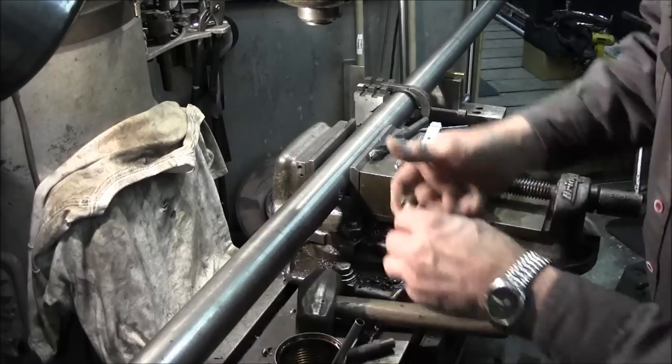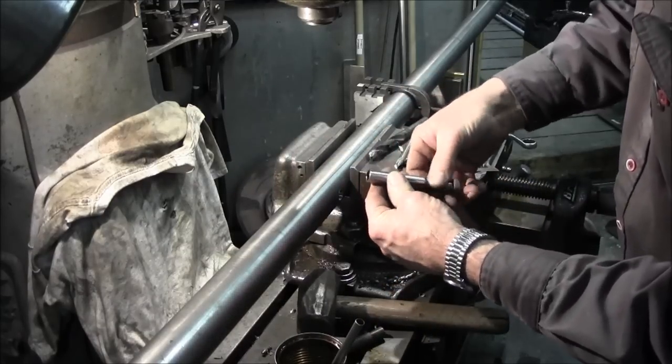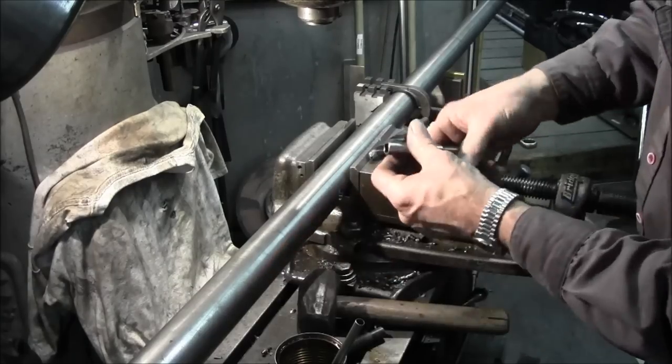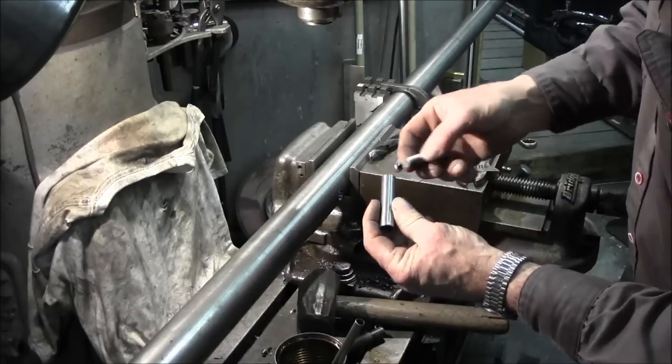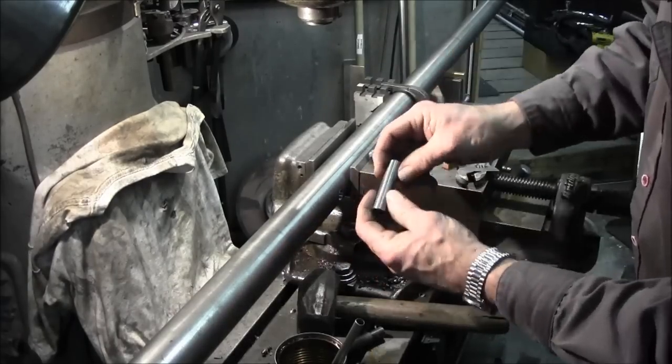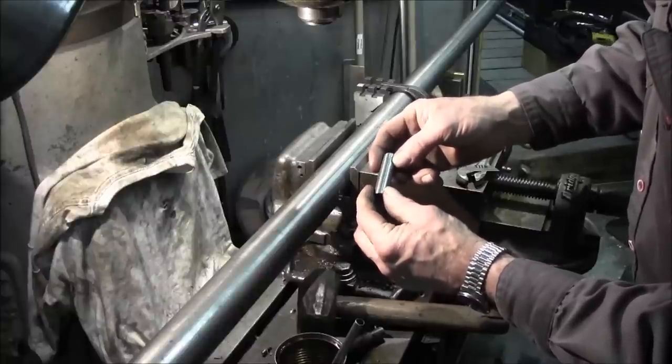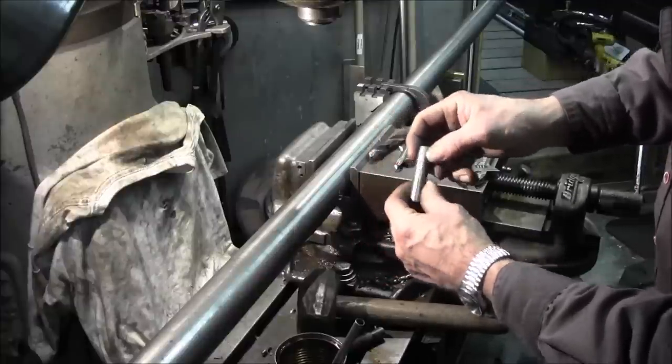Alright. Now we can go safely cut a half an inch off of this, or a little better, and then bring it back in, and then just sand that face. But I like that fit. That's well worth buying a reamer to ensure a really nice fit on there.